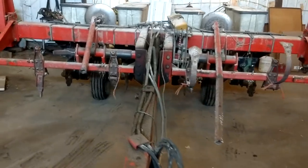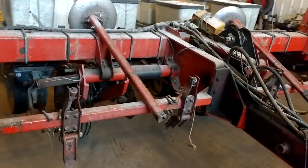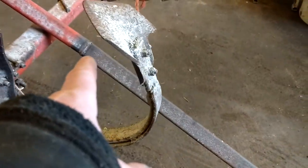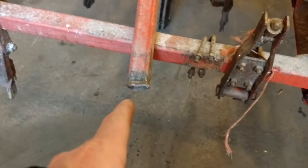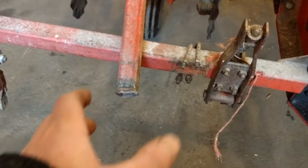It's that time of year — corn planter's in the shop. Making some modifications and replacing some parts. I gotta fix this marker. As you can see, I've got a weld and another piece back onto this one, but my plan is to grind that weld down, put a collar over it, find the piece that went off this side, reweld it, grind it down, and put a collar over there too.